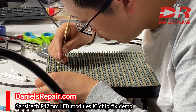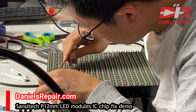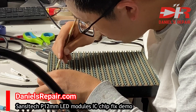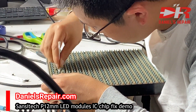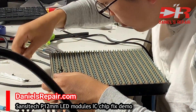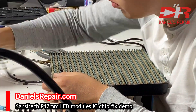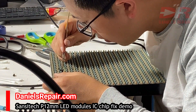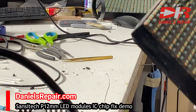If you really want to solve this problem, you have to take out and clean the PCB board beneath the IC chip — make sure it's super clean — and then you can put a new IC chip in.